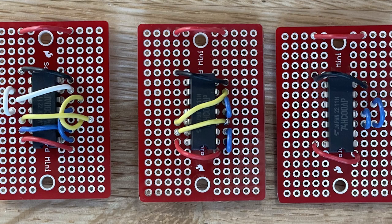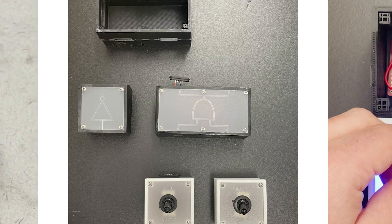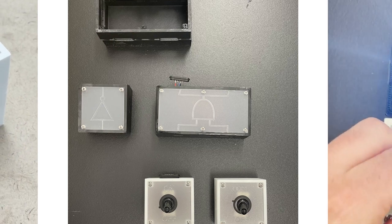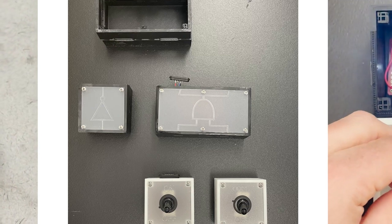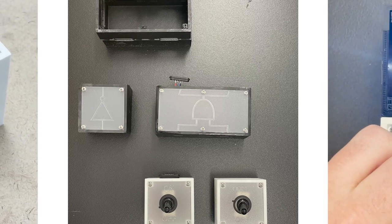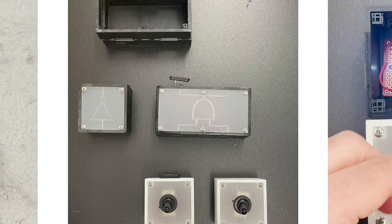There are many aspects of this concept that can be considered as next steps. I have received many suggestions from feedback as well as have my own ideas that were just not feasible to include in this time frame. Firstly, I can produce my own circuit boards to increase the rate and efficiency of production. Secondly, I originally intended to have each block light up depending on its state, not just the output block. However, this raised power concerns since the only blocks with batteries are the input blocks. I could make the decision for each block to have a battery of its own and incorporate more complex board design to light each block using its own power.